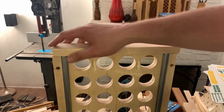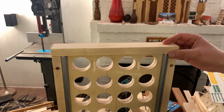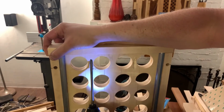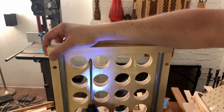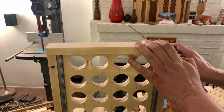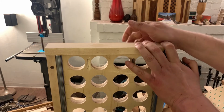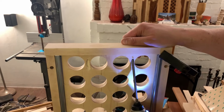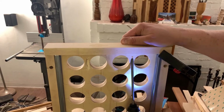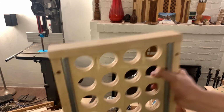So now what we're going to do, we're going to put the front on there, and you can just try to hold it in place and line it up like this moron, but that's really not good, because the thing will creep. Or look, he learned his lesson and put a clamp on there. That's the best way to make sure it lines up, because the front is the same depth as the sides. Okay. All right. Great job. The clamp really helped out.